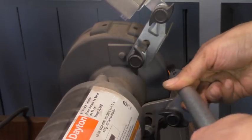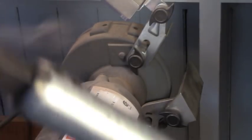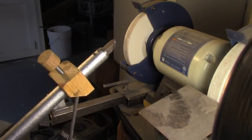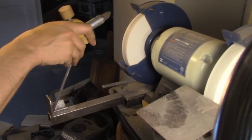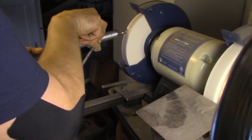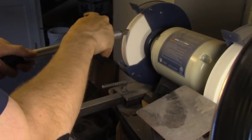Over at the 6-inch high-speed grinder, I'm being really aggressive with the tool because it's not going to hurt this wheel any. I grind, cool it off in some water, and when I bring it back you can see I've got a nice curve and good relief worked out for the tool so it should have clearance when I'm turning. Now I've got it in one of these homemade tool holders patterned after the commercial sharpening setup that I think all woodturners are familiar with. I also welded together the jig on the bottom to copy that really famous commercial setup, and that allows me to put the tool on the wheel and just rotate it back and forth a couple of times to get an even, smooth edge. You can also sharpen freehand, and with some practice that'll go fine.